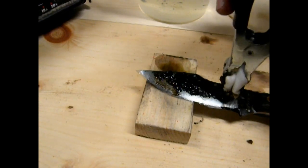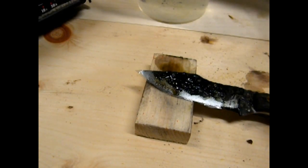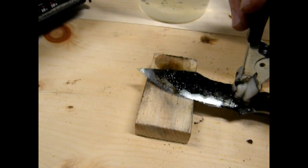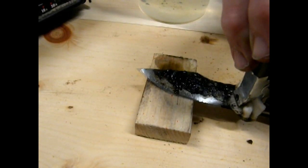This is the second pass — again, just a salt water solution and a 12-volt battery charger. I actually have it on 50 amps. You can play around with different amperage depending on the type of steel you're using — this is 1095 steel. Almost done.